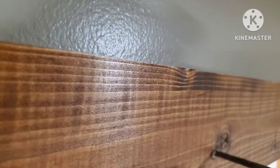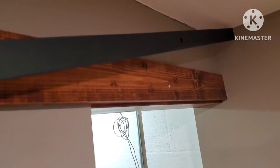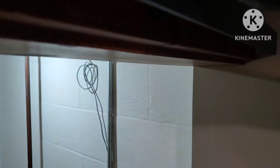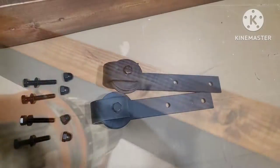Mock up the leg, screw, washer, and then the spacer on the back side. I'm going to pre-drill all my holes for these legs — I got started with the middle one and just snugged it up a little bit; it's a little loose until I get the rest of them in. I wouldn't use an impact driver on these — a drill is a little risky here too. You don't want too much torque or you'll snap those bolts.